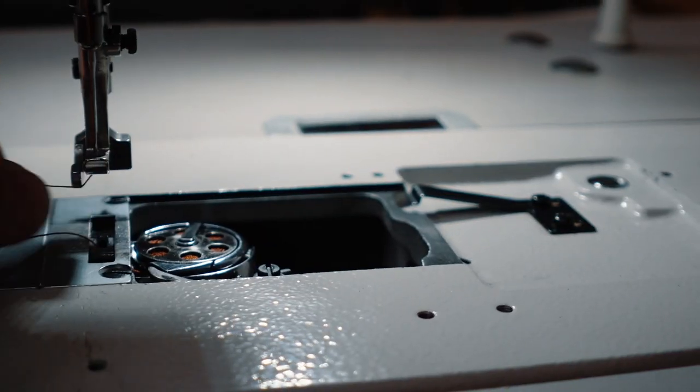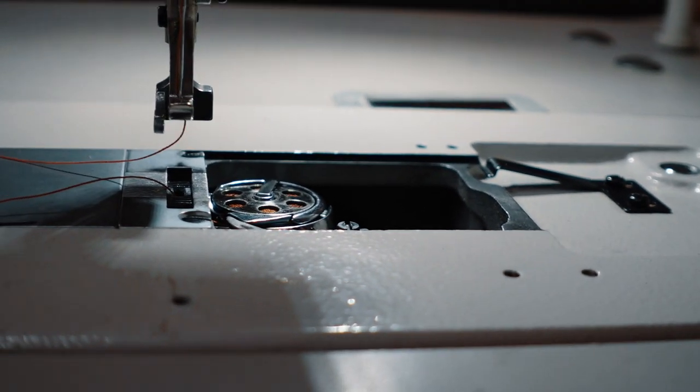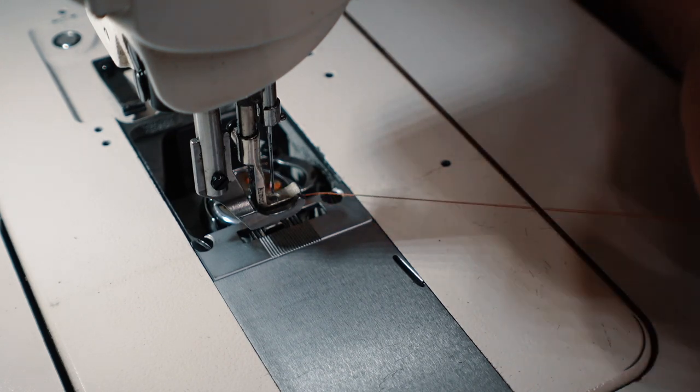Make sure the machine is well-oiled and that the timing is correct. If you're getting a lot of skipped stitches, your hook and needle timing is probably off. One of the obvious ones is make sure you have the basic tension right — that the top is being pulled pretty evenly with the bottom. It's a game of tug-of-war. You want to make sure that the knot lands right in the middle of the leather and not being pulled out the top or the bottom. You can always take the thread and pull it out of the presser foot or out of the feed dog and make sure you're not getting any weird hang-ups. It should pull out pretty smoothly and evenly.